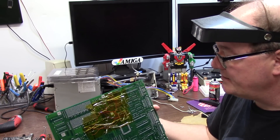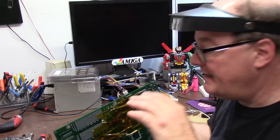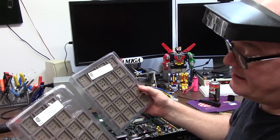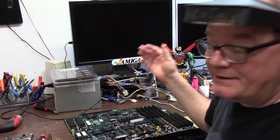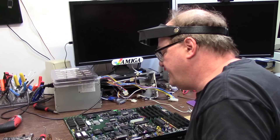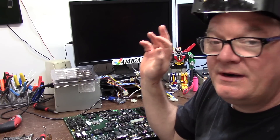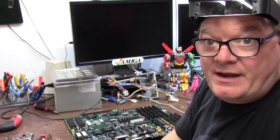I have to take some highly detailed photos because I'm not pin-tracing all this crap again — it took me 20, 30, 40 hours. The idea is I have the sockets, you can see them sitting on the power supply up here. I have a couple of them left — 38 of 40. They all need sockets. These PLCCs have been stretched to their limit for the past 30 years and this DMAC's an original socket — it was in the acid damage hanging on by a thread. So I'm just gonna do it and see how far I get. If I screw it up, oh well; if it works, great.